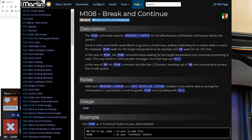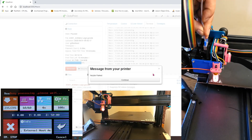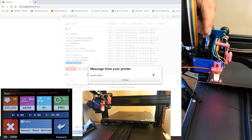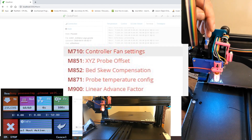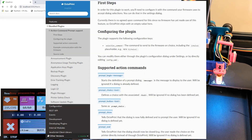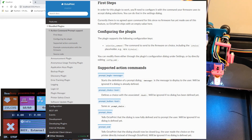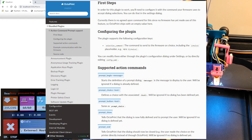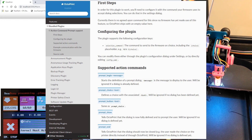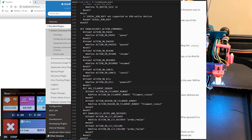M108 is meant to interrupt any process that is waiting to complete. It won't, however, interrupt a process that is waiting for user input — that is why we modified Marlin. We run into the same problem with M876. M876 is something of a private command in Marlin — you will not find it in the documentation online. Octoprint does have some support for it, so there is documentation you can find there, and I'll link that in the description. It also gives a pretty good overview of how host prompt support works.